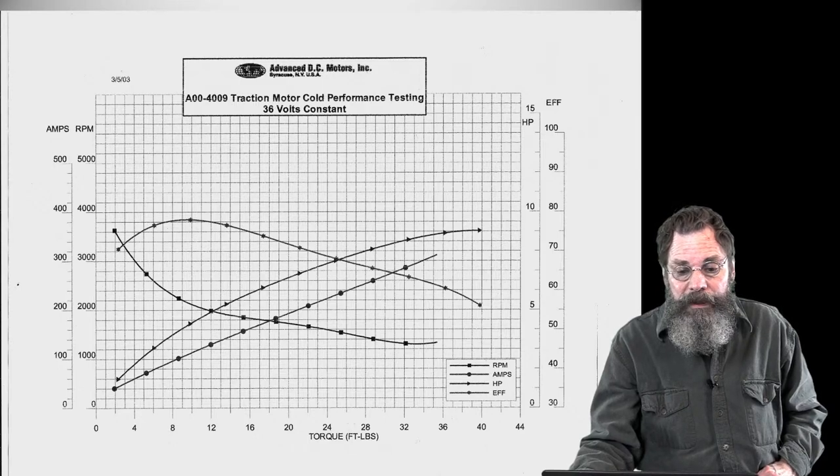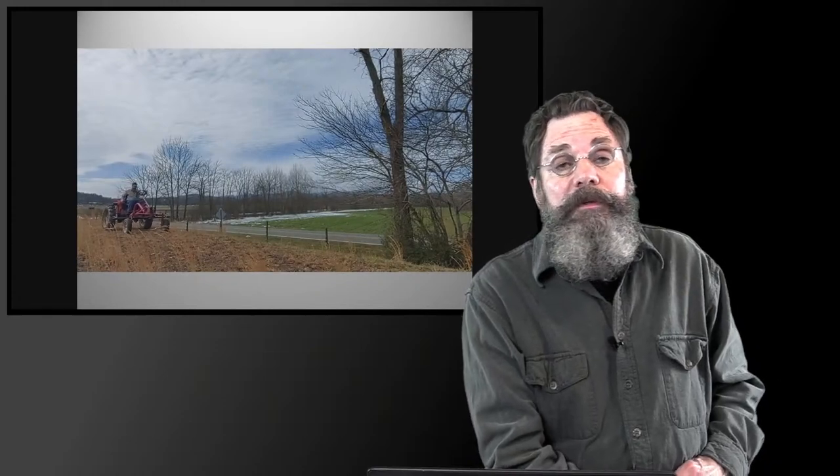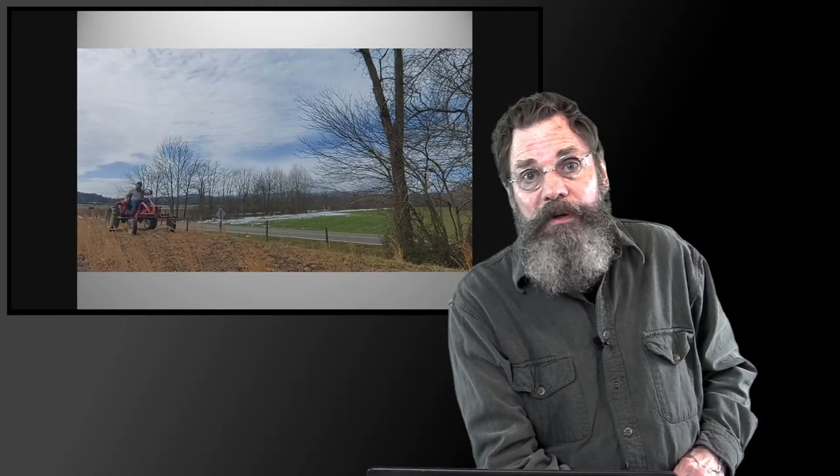So essentially what I'm getting at is that the transmission isn't even necessary. You can bolt that motor directly to the front of the input shaft on the transmission. So that's a 1-to-1 ratio. It's like driving in third gear. And the motor is reversible, by the way, so you can use the electrical reverse as opposed to manual shifting to go into reverse, and you'll have essentially the same speeds forward as backwards. But in third gear, if you remove the transmission entirely and bolt it directly to the input of the differential, you would gain another probably 12 to 16 inches, and probably be able to strap some of those batteries, if not all of them that were in the back, down underneath, give it a lower center of gravity, and keep the weight distribution much more favorable. I just didn't want to do it that way.